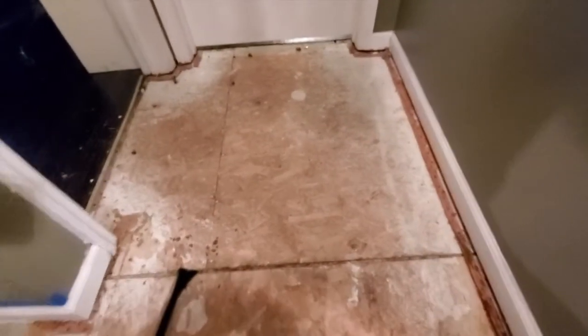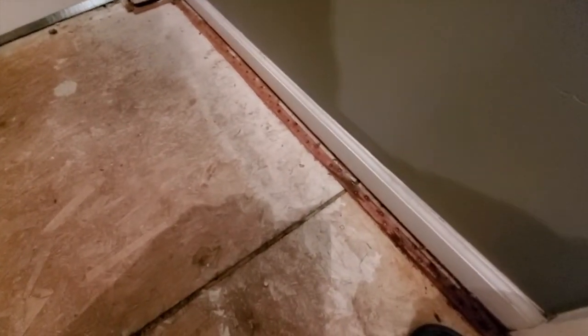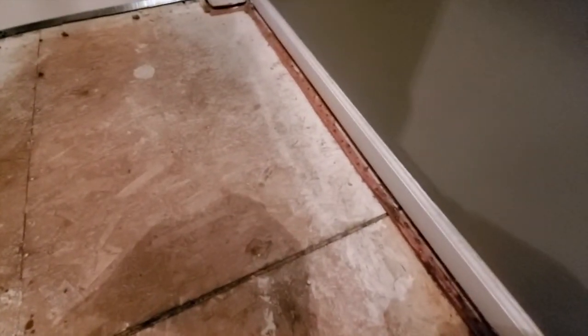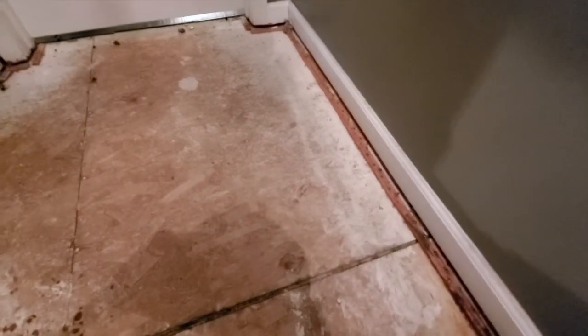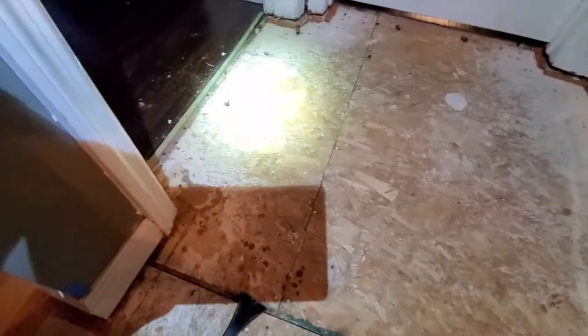Alright, so I'm here taking the staples out and the strip that was holding the old carpet down. A lot of staples, a lot of nails, so you have to pretty much go over the entire floor. Once again, this is vinyl flooring going down, so you don't want anything protruding through once you lay it down. What I'm using is a headlight, so I can see any nails or staples that are sticking up. It helps out a lot. So things are coming together.